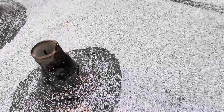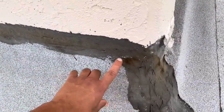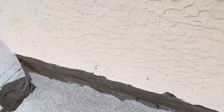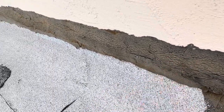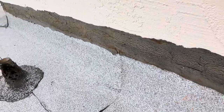This is prevalent around each one of these. Another thing to point out is there is no counter flashing along this wall — what they did is actually just smear mastic on here. So this is done incorrectly. Over time, water is going to have an opportunity to get up and underneath this material because there is no counter flashing to hold the material in place.